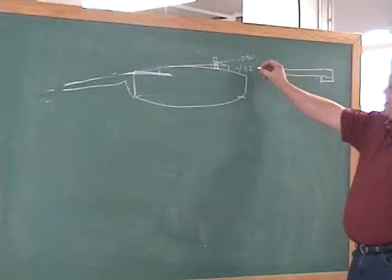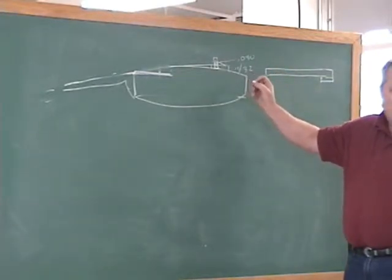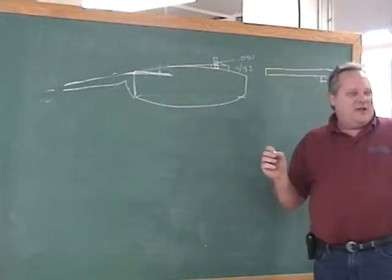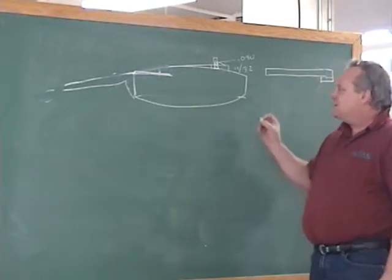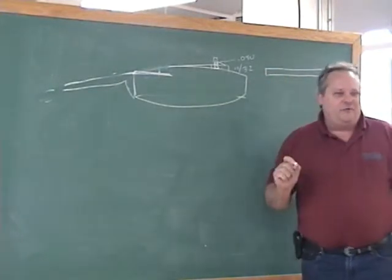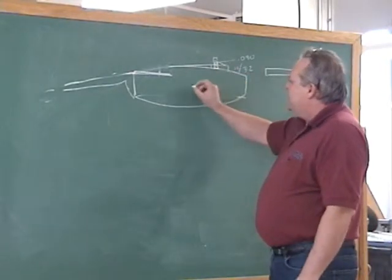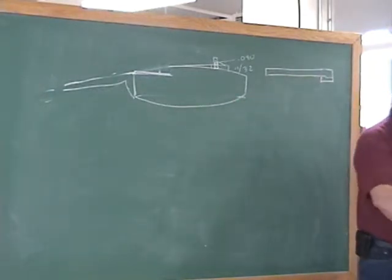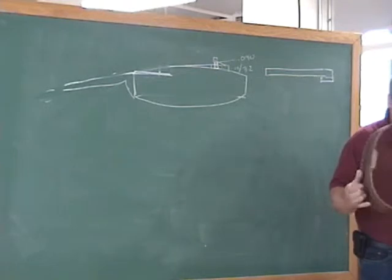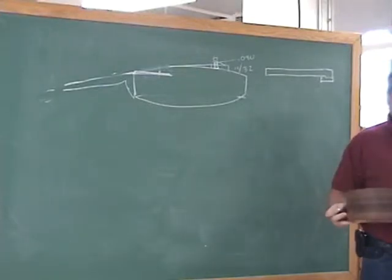Frank Finocchio and I have experimented with this round and round. 28 's too much, 30's too much. 32 feet we're getting away with. 32-foot radius. My next radius form will be 34 feet. So I make my braces a 34-foot radius. I radius the sides of the top in a 34-foot radius, being careful to keep the high point just in front of the bridge. And it yields perfect results every time.